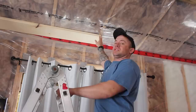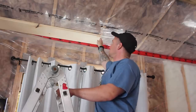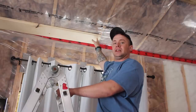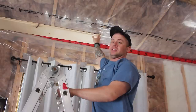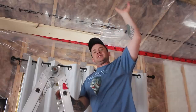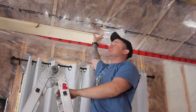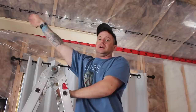So what we're going to do is bring the eight-footers up to this line — right up just eight feet — and then cut the other ones just a little bit so they match, and we'll have hardly any waste at all. You might think it'll look weird with a seam up here, and it would, if we didn't put a false beam right up that seam. We're actually going to put a false beam there and another false beam at about the two-foot mark over here and over here.